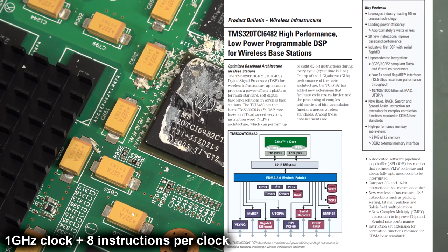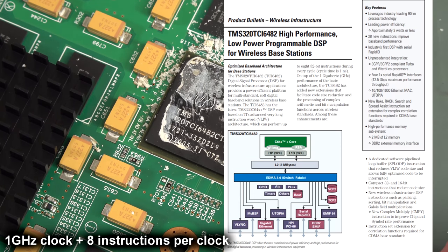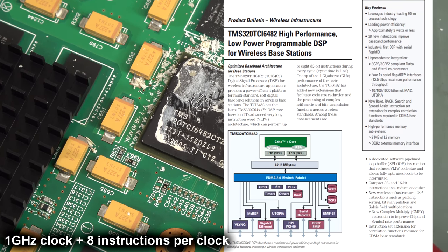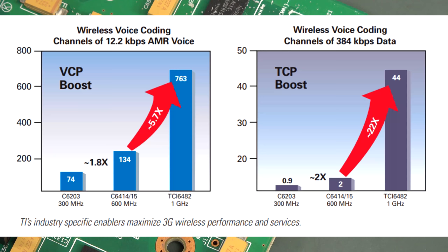And yeah, this would almost certainly be doing the audio processing, because that would be a classic job for a TMS320. It is like the de facto industry standard digital signal processor. And one of the classic uses for these would be real-time audio processing. So yeah, no doubt that's what it's doing. I think this is the audio card. Why are there nine of them? I don't know, an extra one for housekeeping or an extra channel just for good measure. Not sure, but one of those is dedicated to each audio processing stream.